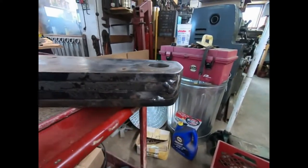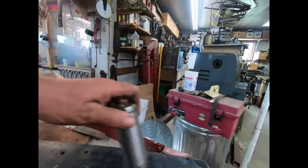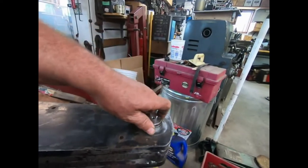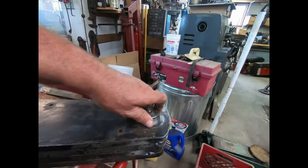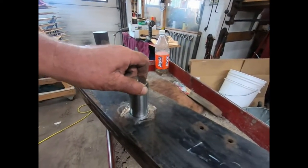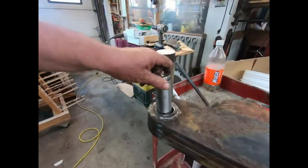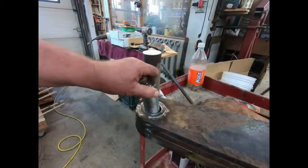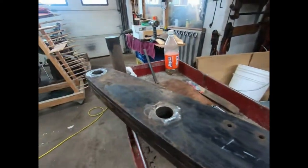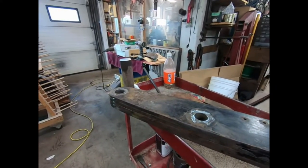Hello, everybody. I got it all welded. You know, three little spot welds. Not much. This, it's lined up good. This side here has probably got 8 or 10 thousandths. Not much. These down here, if you only put it through one of them, it's like, holy cow. And then these down here, it's just plain bad. So that's what lack of grease does. It pays to give them a squirt every day.